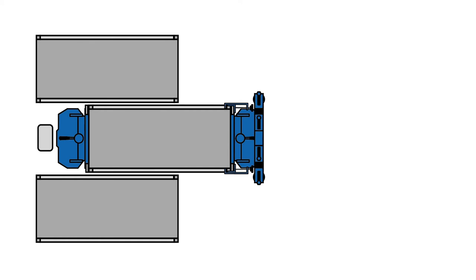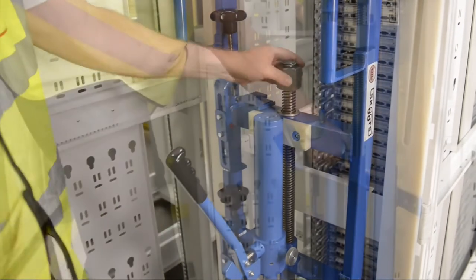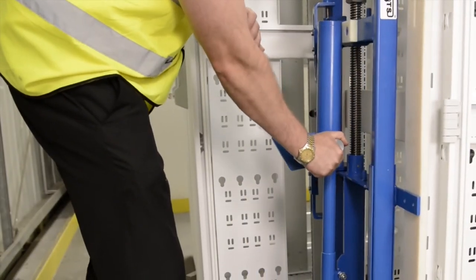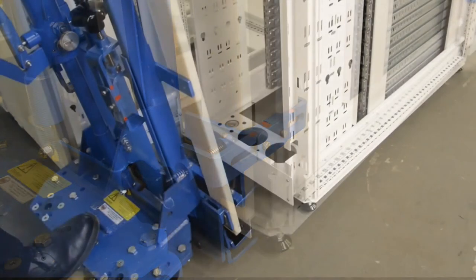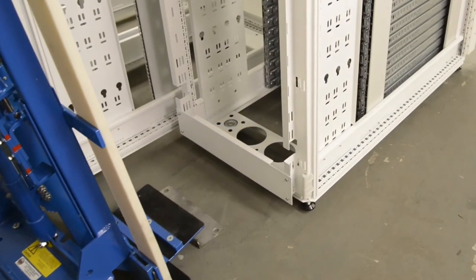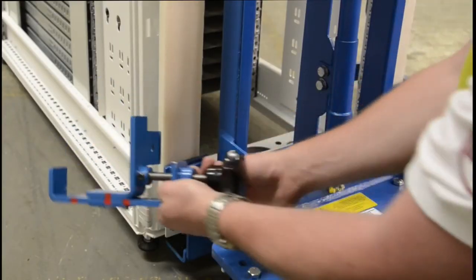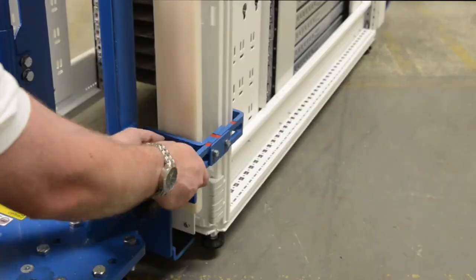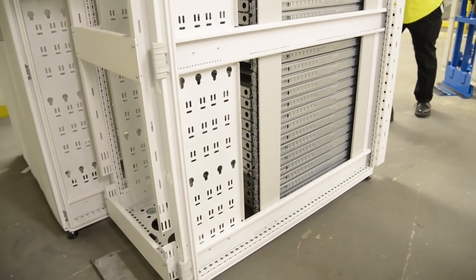When operators are ready to lower the load, unwind the safety backup nut to the top of its range of travel. Lower the load fully to the floor by releasing the jack valve slowly on both ends of the load at the same rate. Remove the leading scoots unit. Remove the four adjustable clips from the trailing scoots unit and remove the scoots unit. Push the load into its final install position on the casters fitted to the data enclosure.